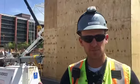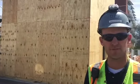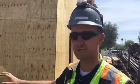So this was a product of go and see with the rebar folks to get rid of a problem which we always have, which is having rebar all over the job site, causing wasted motion, wasted inventory, defects, things being in the way, the whole nine. So this is safer, more productive, really tailors to our job site because we have a curb-to-curb job site. And so that's the lean improvement, to go do a go and see, talk to our suppliers, and see if they can better supply materials when we need it the way we need it.